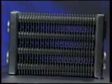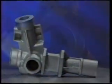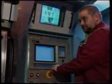This process produces parts which have high-quality requirements, such as these domestic boilers with large internal cores, thin walls, and multiple deep fins, as well as these safety-critical automotive castings. Since each mold can have multiple impressions, production rates can be very impressive. Even single cavity parts can be made at greater than 450 molds per hour. Some of the castings made with this process are shown here, along with their production rates.